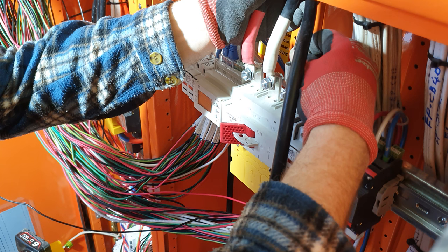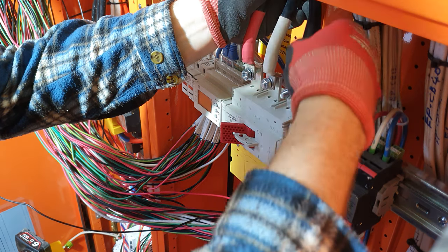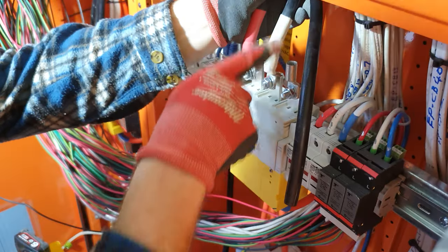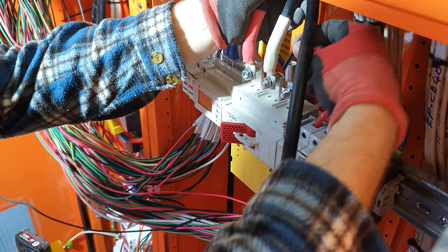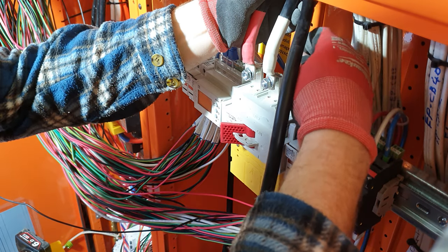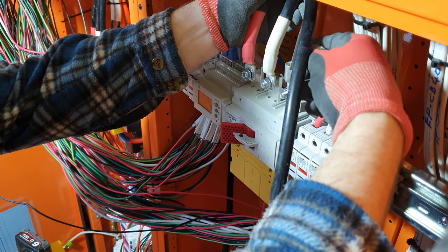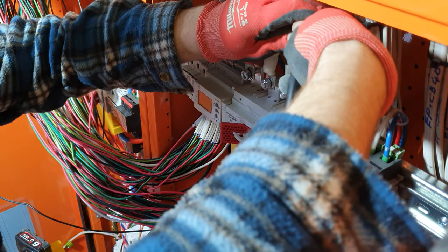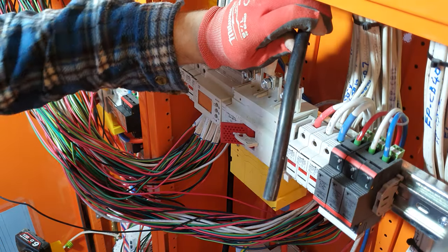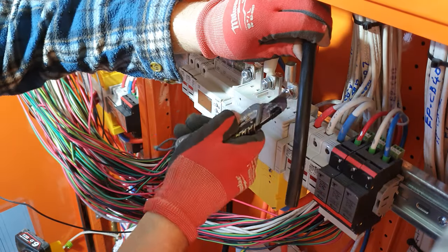What you do now is simply have it pinned with that hand, then pull this cable tie up. You need to stay on the bottom as well — the bottom of the cable is where you've marked it, because the bottom is where the top bit goes. That bending radius is pretty reasonable. You pin the cable there and mark it with your knife — just put a cut into that. That's the end of the lug, so I'll cut it there with the cutters.